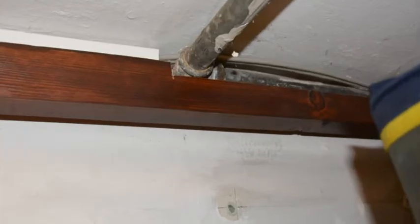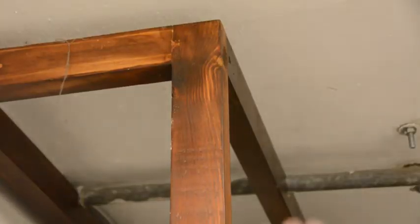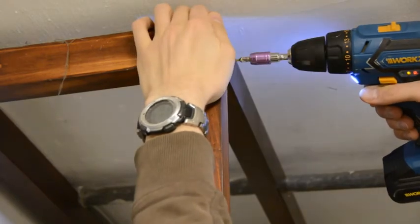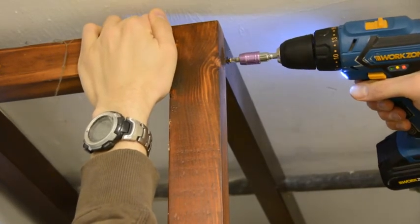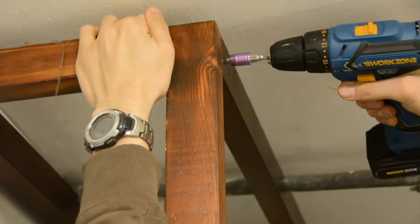As the shelf doesn't have a back panel, you normally would either secure to the wall or screw some kind of cross brace to the backside. After all the notches are created, the actual assembly is easier than putting a piece of IKEA furniture together. I just put it loosely together and drive in the screws that lock the tenons in place.